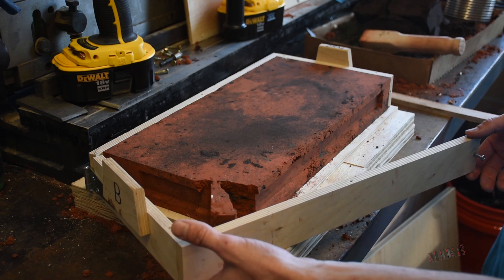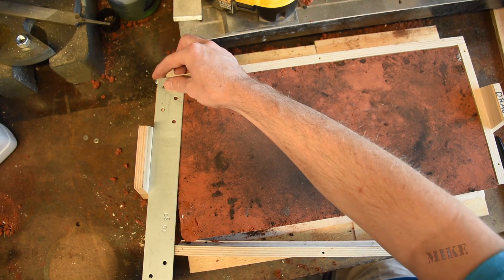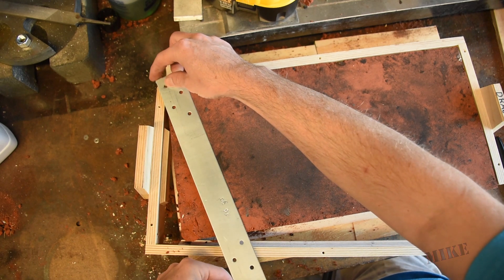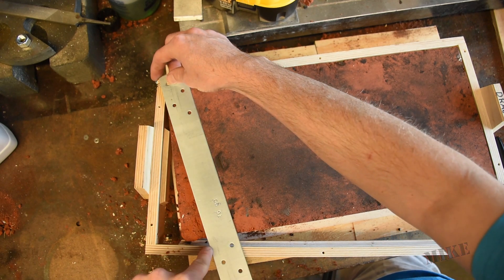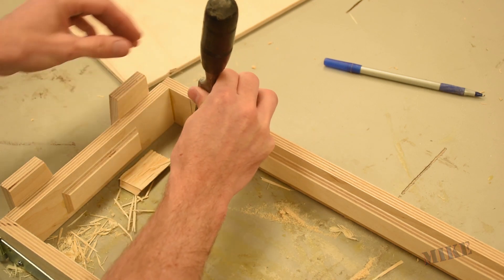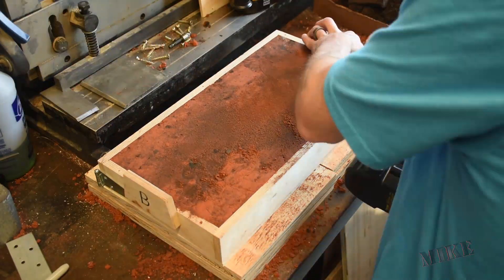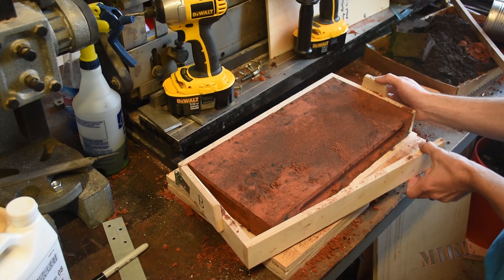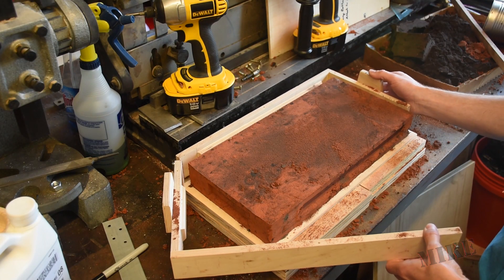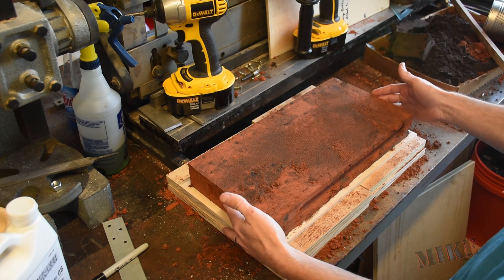My corner got caught — I didn't account for the hinge radius on this corner. It hinges like this, and so I have to trim off my grip strip right here where it will intersect the mold. It's quick work with the hammer and chisel, and I'll repack this corner really fast. Perfect — the flask releases quite nicely. Here's my shortened grip groove and the end ones.